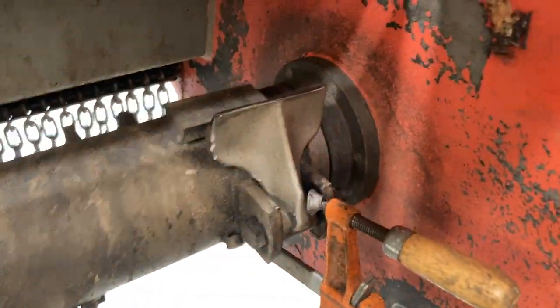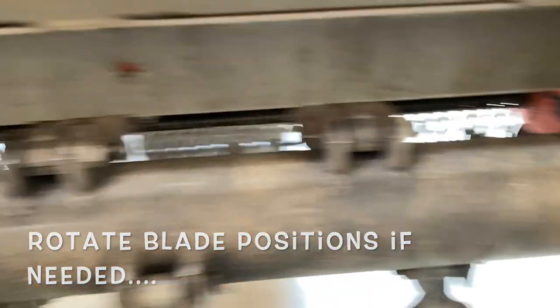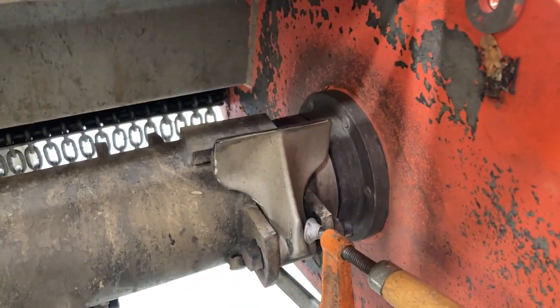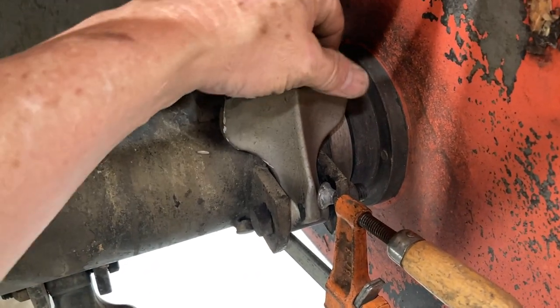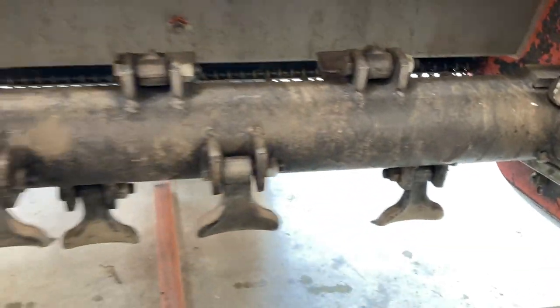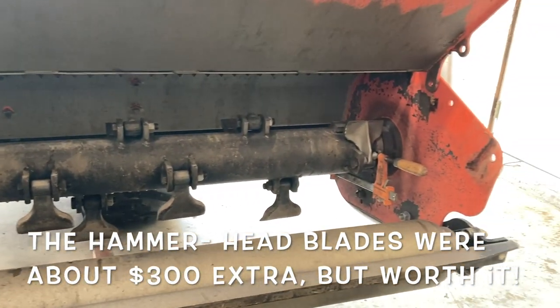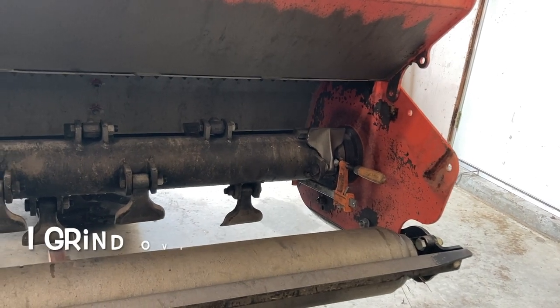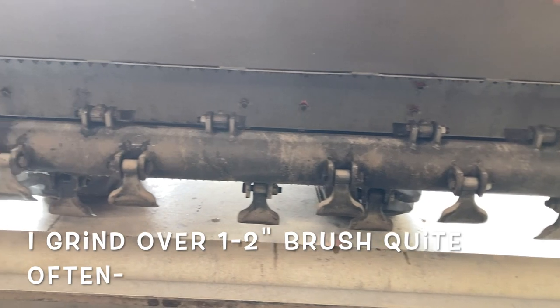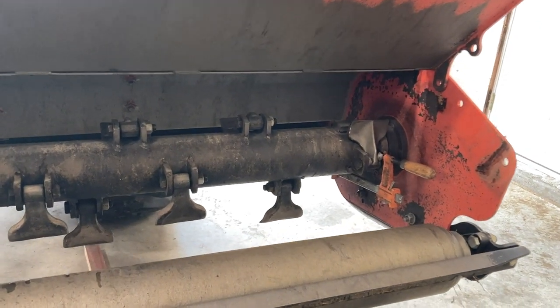One thing I've noticed on these outside blades — that little outside corner right there tends to get worn on both the outside cutting heads. Periodically I'm going to want to replace one, put it in the middle, take one of the middle ones out, put it back here, just so we get even wear on the blades. I just try to approximate the original angle on that thing. Compared to the wide blades I had on this at one time, these last a lot longer between sharpening, plus I can grind them up. I have to admit it — I put some two-inch branches down there and just slowly babied my way over those things and turned them into mulch. This thing's a combination between a mower and a rototiller.